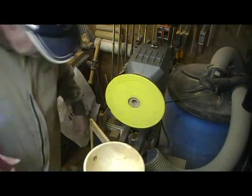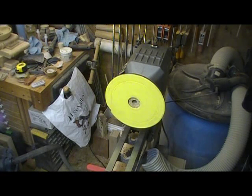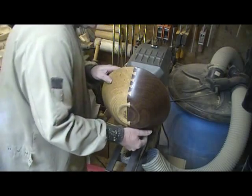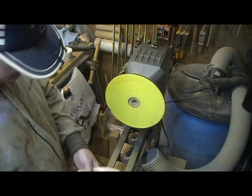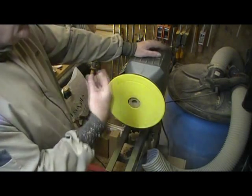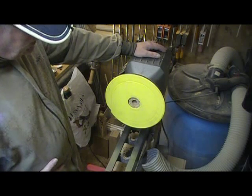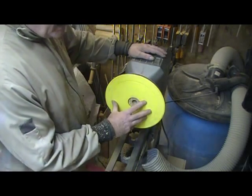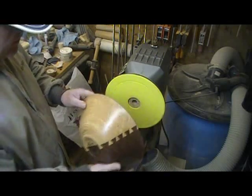Wait a minute. Before I take that off, we'll try a test with a different bowl. This one is larger than the chuck, so it's going to be the full ten-inch diameter of the chuck. The radius is five inches, five squared is twenty-five, times 3.1 is about seventy-seven, times two pounds of vacuum — so I'm talking around 150 pounds of pressure holding that on there.